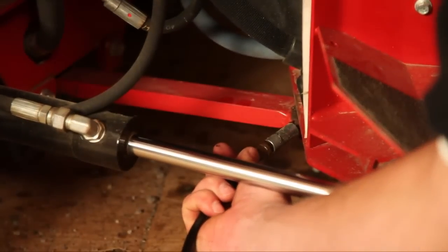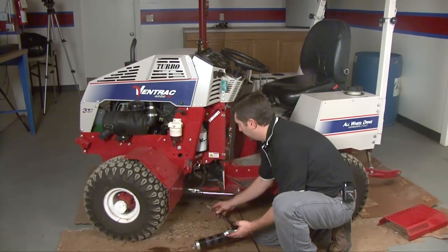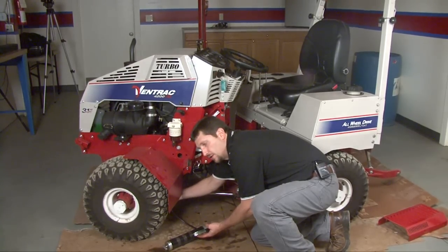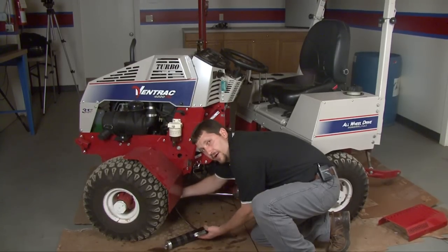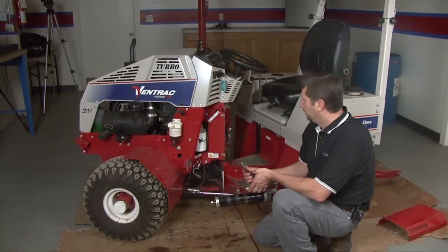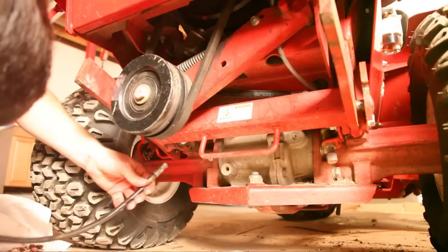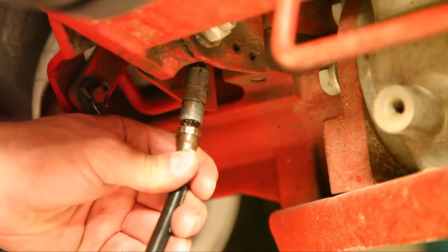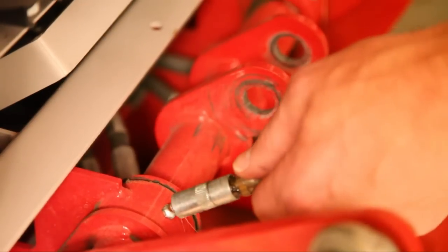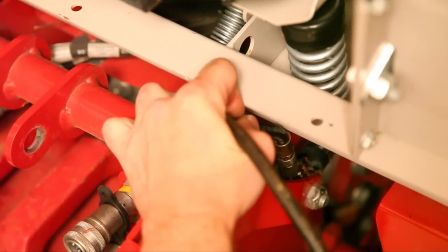Here at the center, these two bottom points are probably the two most important. To get the front two — the cylinder and the bottom belly bar — you'll need to crawl underneath the tractor, or easiest would be to have the unit up on blocks or a rack. The front cylinder is accessible if you want to lay down on the floor to get it. Moving around to the front side, up on the front hitch arms — raise the hitch arms all the way up for best access. If your equipment has the optional three-point, you'll have three grease zerks: two at the top on the pivot points and one down lower on your cylinder.